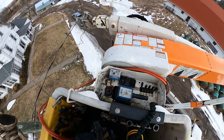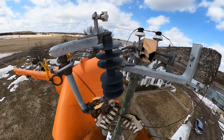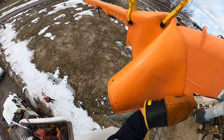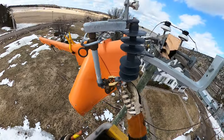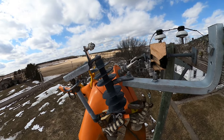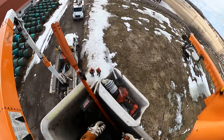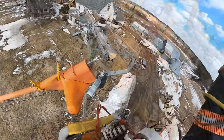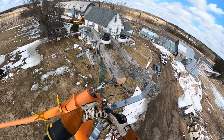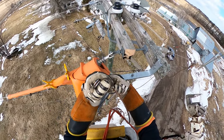Right here we're brushing that copper — it's corroded quite a bit, shiny copper now has a brown-green color. You want that shiny copper color going into any connections. We're going to tighten that up; we're real close to the high voltage here so we'll use hand tools moving forward. Some guys ask about torque on connections like this — I don't think I've ever seen a lineman use a torque wrench on a cutout, but it would be about 45 foot-pounds. Putting in the top lead now with the tap clamp on it, you have to be especially careful — that lead's probably three feet long and you don't want to swing it. I have the loose side dangling towards my bucket, definitely not over on the live side.